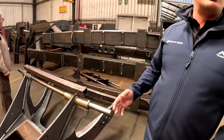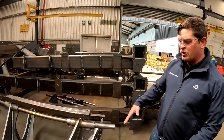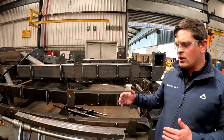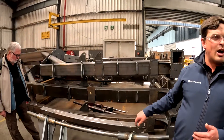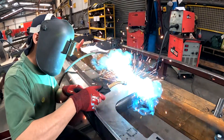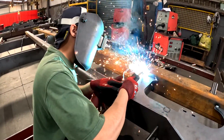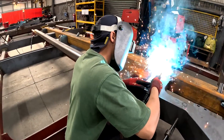With welding, as you know, welding always makes it hard to keep stuff straight. With these long, big profiles which we like to use, you've really got to support it for that cool down and heat up process. So we line it up with the pins and actually add a brace that gets removed and cleaned up, just to keep those inch points exactly where they need to be. We lock them in at the build-making process, so when you're fully welding, you don't have to worry about distortion in the metal.